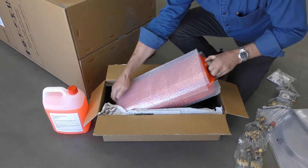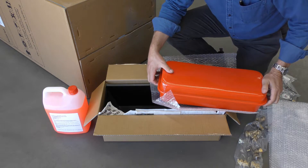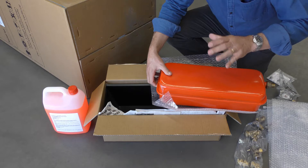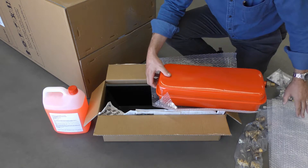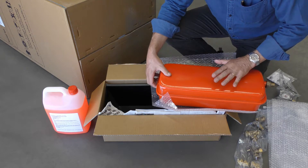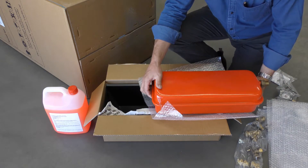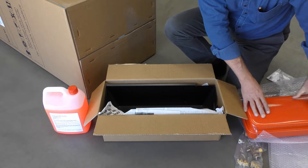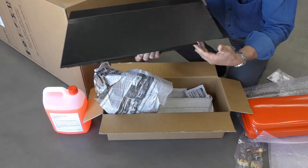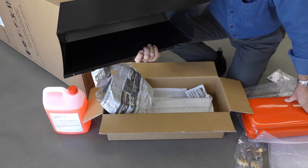Last but not least is the expansion vessel. This is used in all our systems. There's a no-load test in the AS2712 testing requirements — when the thermosyphon arrestor valve closes off, expansion will occur, and this vessel takes up that expansion from the collectors. So this is a necessary component of the installation. It's connected to the top of the tank, and we've got a mounting kit provided for this in the tank. Last is a cover which we put over the top to house it — the red doesn't do too well in the sun, so this cover prevents discolouring and helps with weatherproofing.